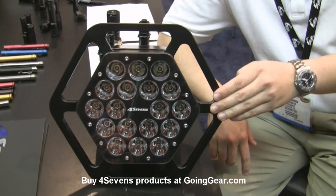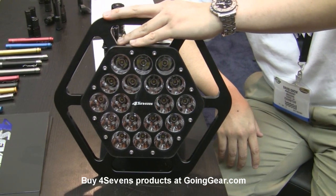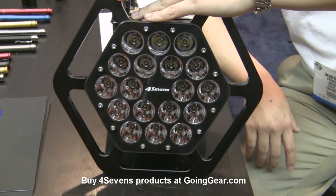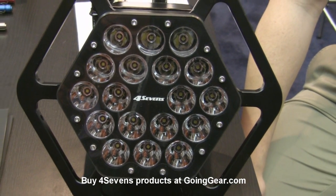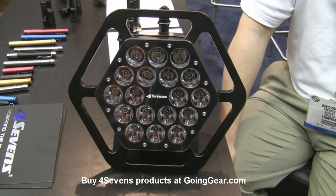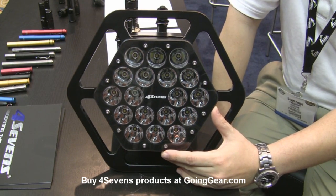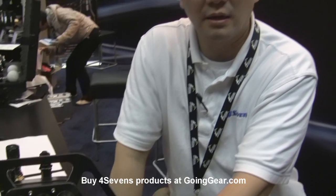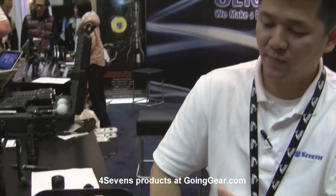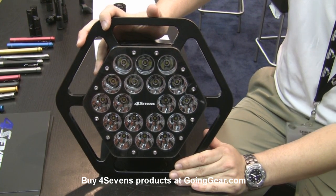What's unique about it, first of all, is that it's got XMLs. It's been on the market about two months, and we've already got a light like this on. We actually worked on it longer than two months — it's been the first half of last year. We worked very closely with Cree and had special access to their prototype LEDs. We actually shared this concept with them as well, and they were just like a bunch of kids in a candy store when I showed them the drawings. There are 18 XMLs, and what's unique about them is it's broken some single die records. It's like 160 lumens per watt at 1,000 lumens at 3 amps, which is absolutely unprecedented for a single die. So we decided to make the most out of this leading-edge LED and put it in a package that is actually very unique as well.